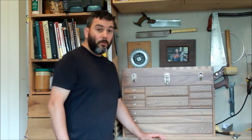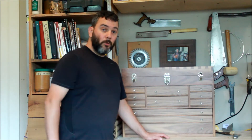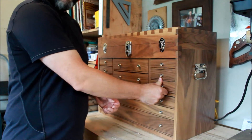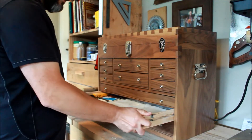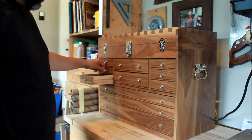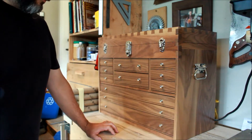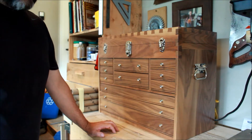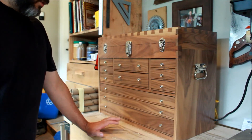So I have the tool chest in my shop for about five to six months now, and I have some little things that are happening with the drawers, so I want to show you what's happening — I'll get you guys closer. Basically, the drawers are starting to be harder and harder to push, and in some cases I'm having a really hard time with this one. So what I want to do is put some wax on the tracks and on the sides. It's the same problem as when you have a very old chest — like your grandfather's chest — where there's no tracks and there's wood rubbing against wood, and that's what we're going to try to fix.